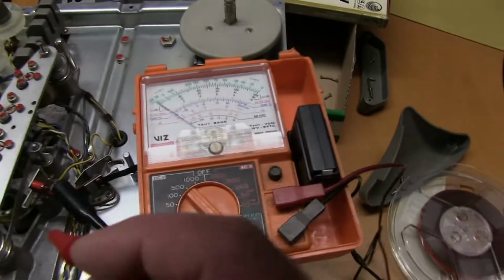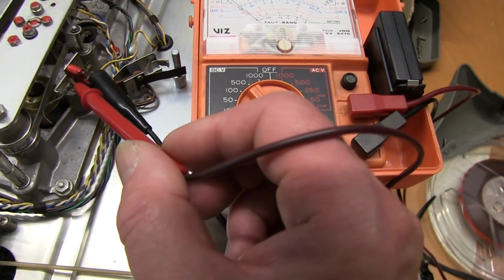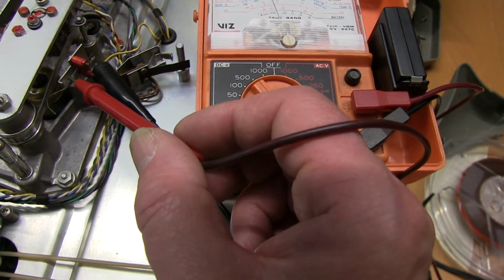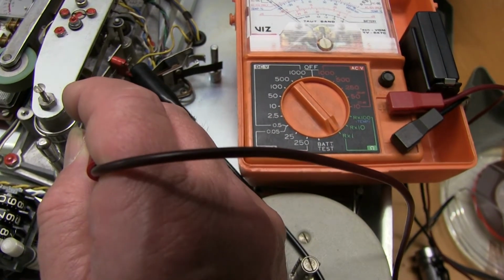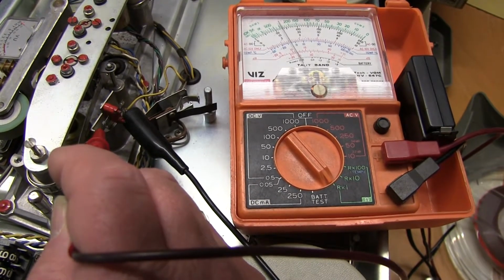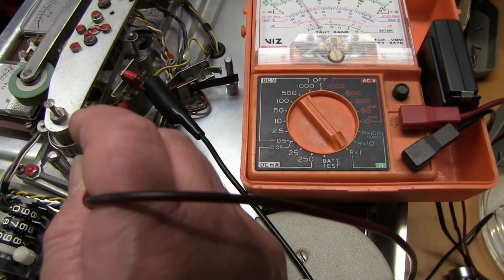And then on this machine you can tell by looking at this meter here, just an analog ohm meter. Now that is supposed to be a short circuit on there. If I just rest it on there, it's not a good contact. You have to literally, I've got to push it to get a good contact. So I've got to clean this and perhaps bend this to get a bit more force.